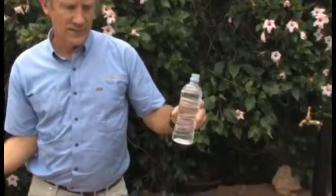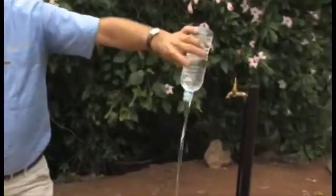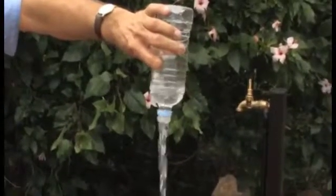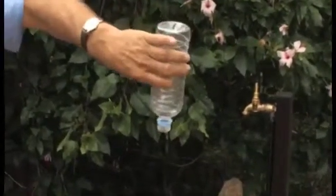And probably the best way to describe that, or show that, is this analogy with a couple of water bottles. So we're trying to draw an analogy here with the effect of the vent. So this water bottle here is a standard water bottle. We tip it upside down, and the water does flow out, but it sort of goes glug, glug, glug, and takes a little while to flow because of that vacuum that's been created behind the water as it leaves.